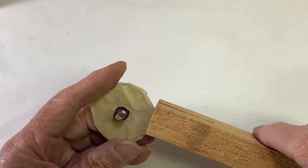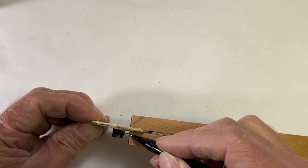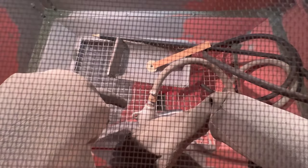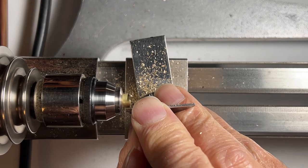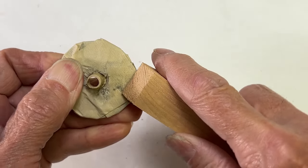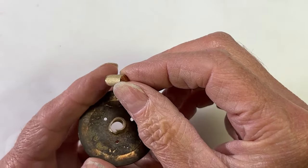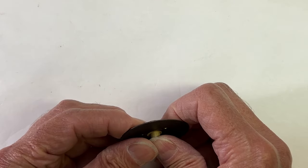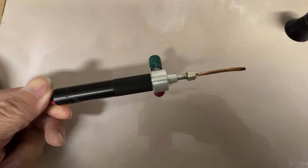I'll make a temporary sandblasting processing holder and put a couple of relief cuts in it. Then I'll rough saw the abraded brass rod to length and true up both ends. After removing the sandblasting processing holder, both surfaces have been abraded along with the inside. The fit is snug but fairly loose in areas — nicely set up for the next step. I'll be using the small oxy-acetylene torch.